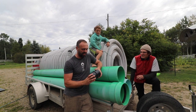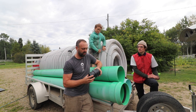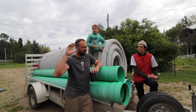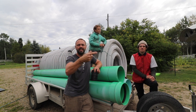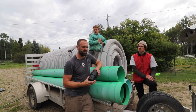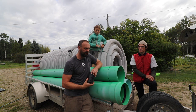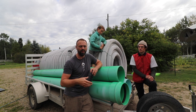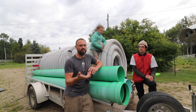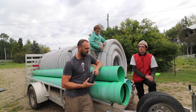There are seasonal effects going on here, which was not something I expected — that's really neat and there's an opportunity to improve upon it. We're also going to install a transpired collector — a solar air heater on the back wall of the greenhouse. When the sun is lowest in the sky, it hits dark material which heats up, and the air we suck from the greenhouse goes through that transpired collector and underground. That had a huge impact on overall efficiency. We also found that longer pipes between manifolds are better than shorter pipes. As we build this and study it through winter, our design process will improve, and we'll include those optimizations in the greenhouse design tool — link in the show notes.